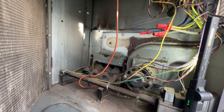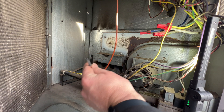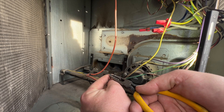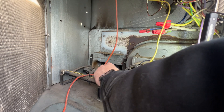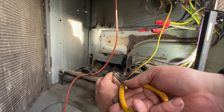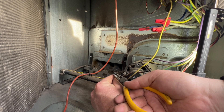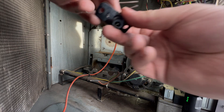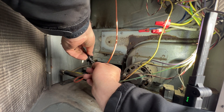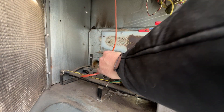Something I just noticed as I was pulling those wires off — they're really loose. We're going to tighten these by taking some needle nose pliers and squishing it just so it'll be a little bit tighter on the post. Just barely — you don't want to overdo it. This brown wire that we pulled off is going to ground, so we want to make sure that's tight too, otherwise it's not going to spark properly. The orange one goes into the plastic connector — it's much tighter already. If you have one that has a metal base, it won't have a ground connection because it doesn't need it.